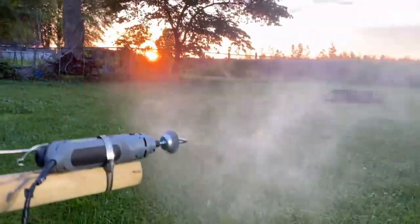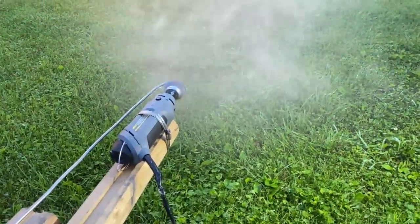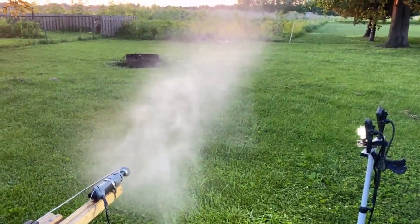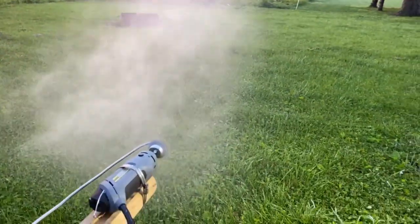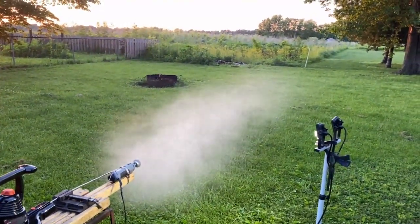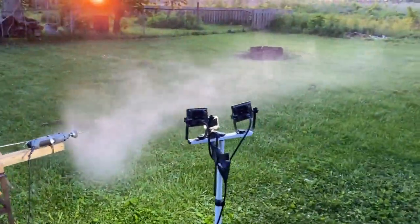Those arrangements typically require multiple nozzles on a large burner, which is even more expensive. I want to try and get a configuration like this working as simply as possible. We're going to do a jet engine type combustion chamber where this sits at the back with a firewall protecting it, a little control air on the back wall blowing the fuel stream in the proper direction, then a combustion can and liner covering it. We need jet engine heat here — they want to get that rock melted as fast as they can using waste oil, and it's been taking over a day. We're going to try to reduce that burn time and bring down their oil usage.